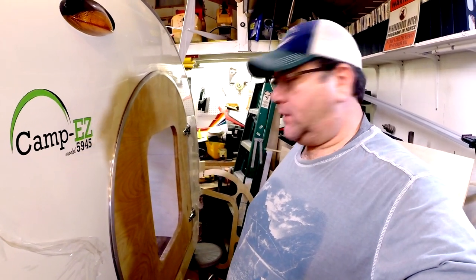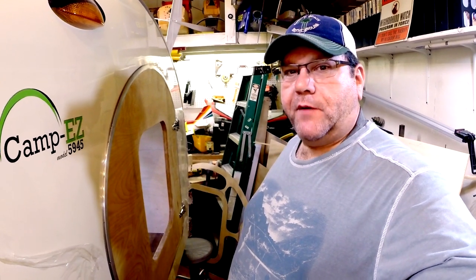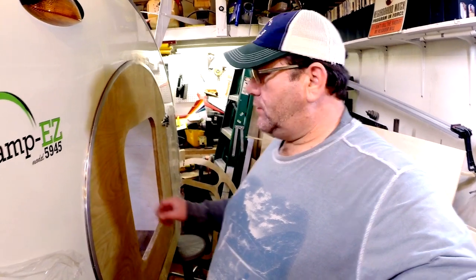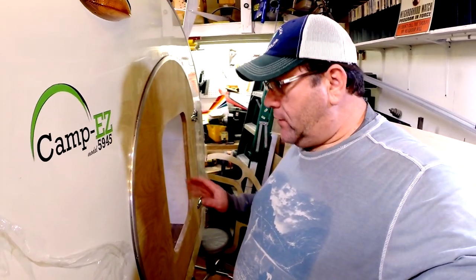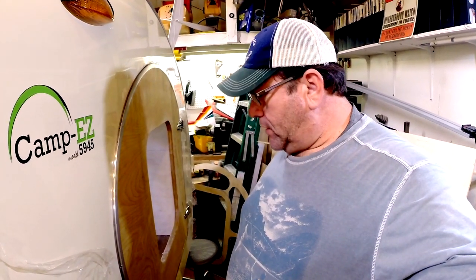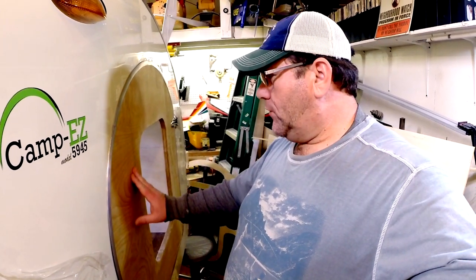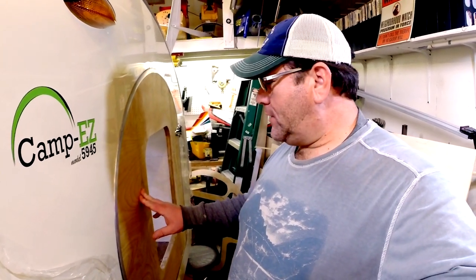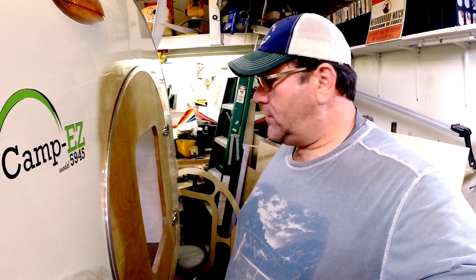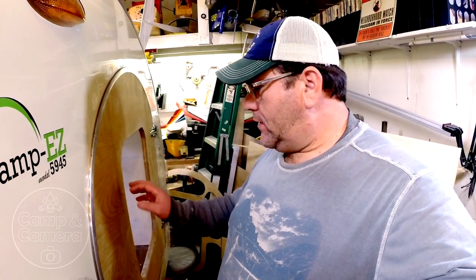This is a big success. We've got a door framed up with the aluminum trim and two hinges installed, so I know it's going to open, close, and work okay. I've been planning and drawing things out, and it looks like it's all going to come together. Next time we'll hopefully have the skin on — I don't know if it's going to be green like the original pictures I drew or the ivory color of the camper. If you have any suggestions, put that in the comments below.